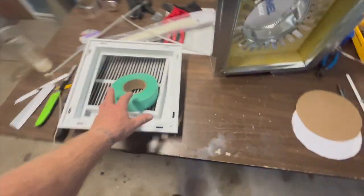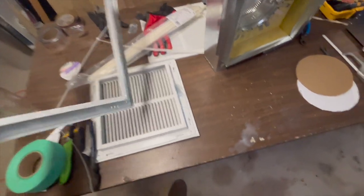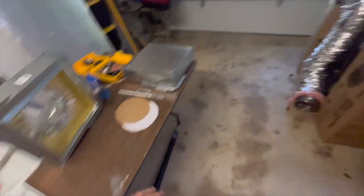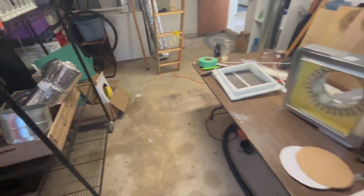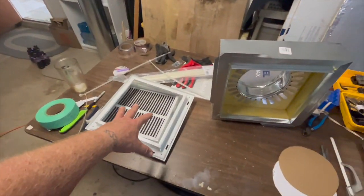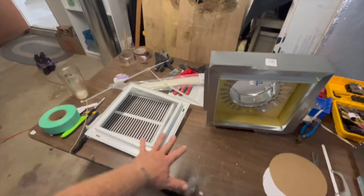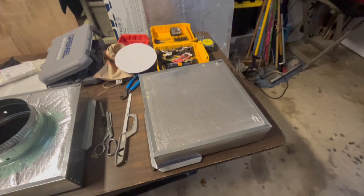I got 12-by-12 registers so I can't make a mistake on the doors — they have little doors and you can put filters in. I'm going to go with some real cheap filters because I want airflow. I did an eight-inch main line trunk line, maybe should have done a 12-inch, but I went with eight, so I'll use cheap filters to let airflow get in there.